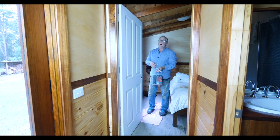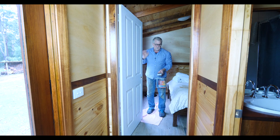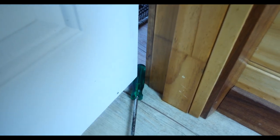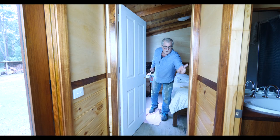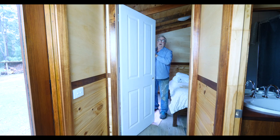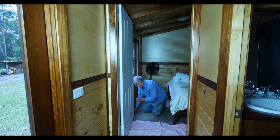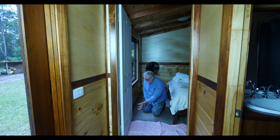My two edges are painted. The next thing I do is paint the back of the door first. I close the door right down at the bottom of the jamb and put down a screwdriver, a piece of timber, or a caulking gun — it doesn't matter. It just stops the door from closing so I don't get any paint on that little striker plate. I'll paint the back since it's difficult to film in here, then we'll paint the front. Put your stick or caulking gun at the back corner of the door so it doesn't close and hit the wall or the skirting.